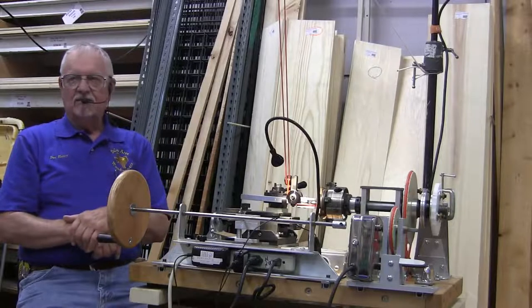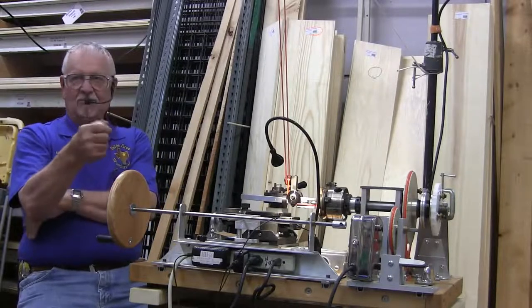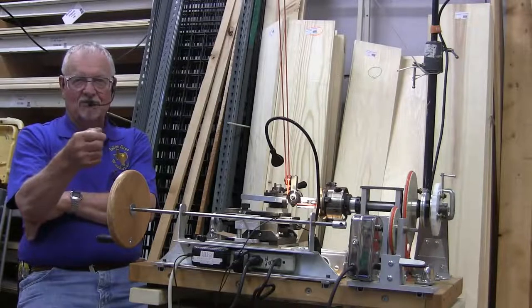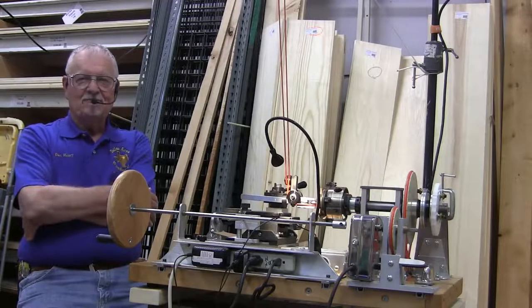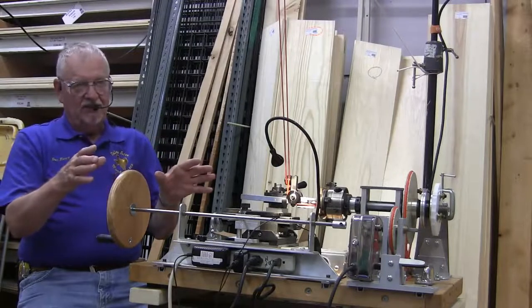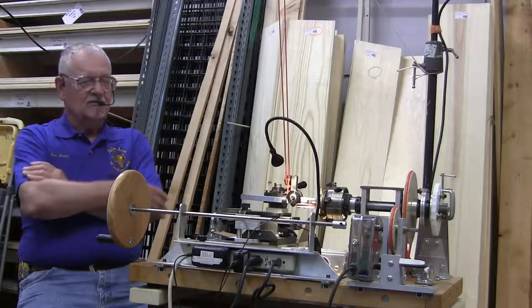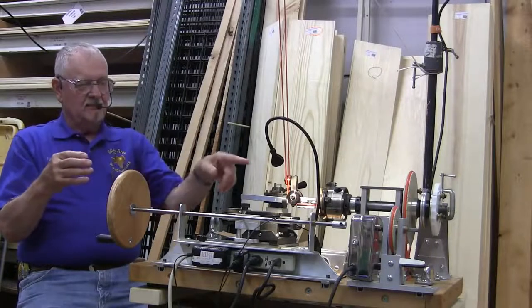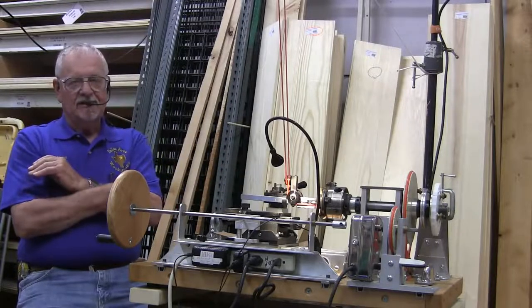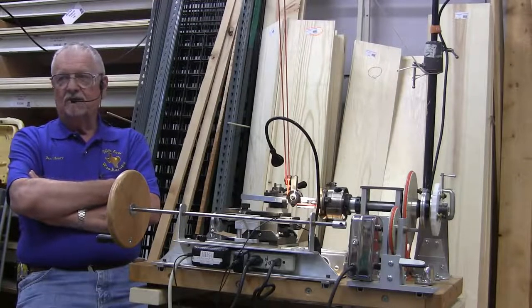A machinist, somebody back here today is a machinist, they will take a mallet and they will tap that into being round, if you can picture that. So that you've got it rotating perfectly. But you use a dial indicator so that dial is not deflecting at all. It's perfectly round. But since I've got the Morse taper, I very seldom use my leveling chuck. I just don't need it. Any questions at this point?